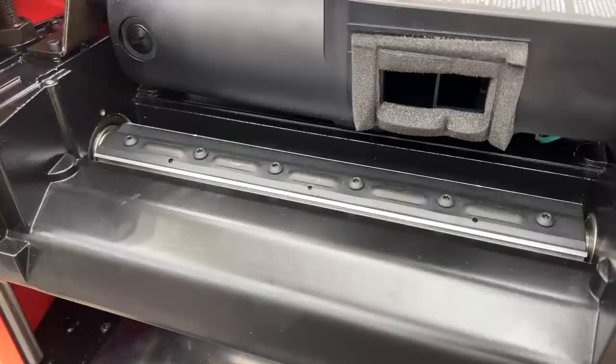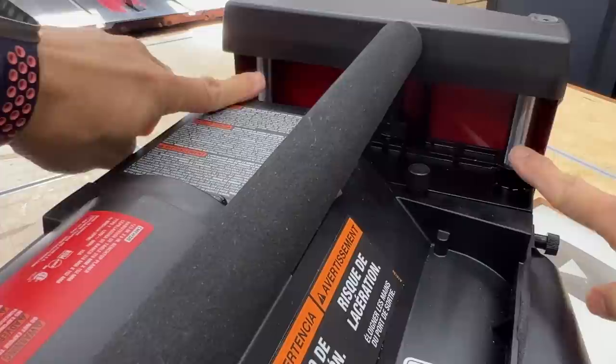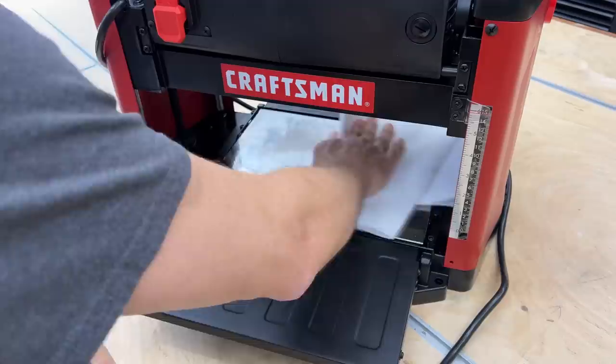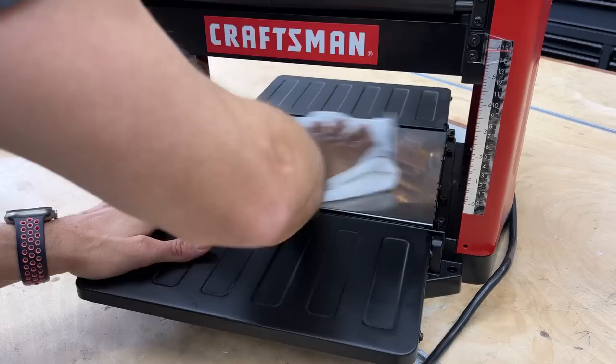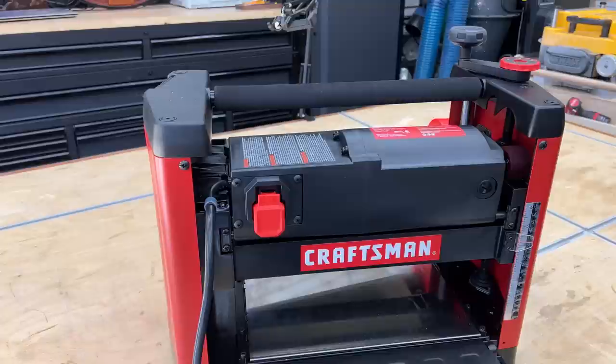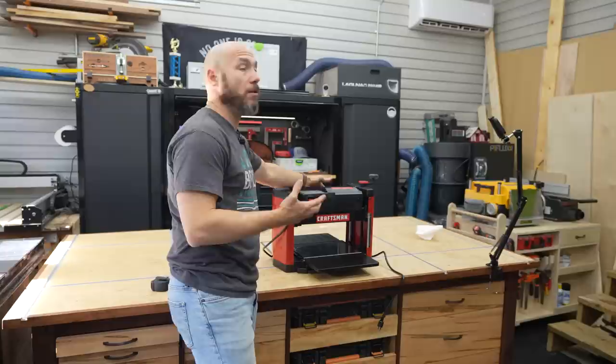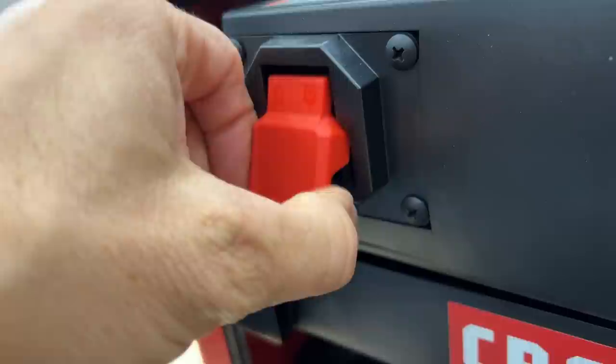Not only does the screw raise it up and down, but it also has posts on each corner — four of them that the whole carriage rides on — so everything stays nice and parallel. When I first get tools like this planer or jointer, I always put down either paste wax or our own Outlaw's Board Butter on the surface. That helps everything slide smoothly so your boards just glide across much easier, and it doesn't take much — just a thin coat. The construction of this planer is pretty solid for the price. It's aluminum and plastic for the most part, but all the mechanisms, the sides, and the bottom are aluminum. The only plastic pieces are around the blade shroud and the motor housing.